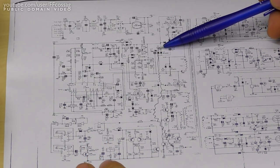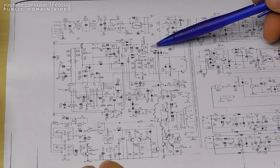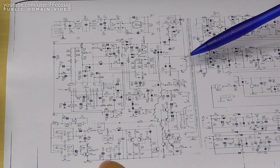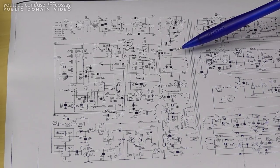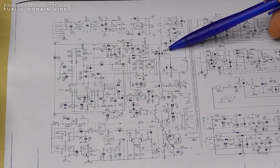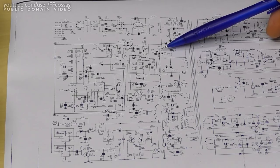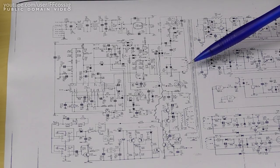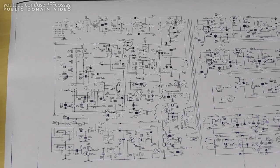The purpose of C14 here is to contain some sort of waste energy which would otherwise just be lost in the switching of the main power transformer. I'm not entirely certain as to how it works, but the gist of it seems to be that it's getting charged up with waste EMF through these diodes. So something which would cause an overvolted situation is if perhaps one of those diodes failed, maybe, or if something has caused huge losses in the transformer, such as a switching circuit going kind of haywire and putting out really short, sharp spikes or something, which would just result in losses rather than real energy getting carried over to the secondary due to saturation of a transformer or something.